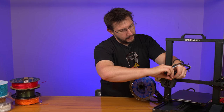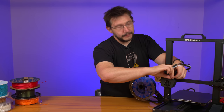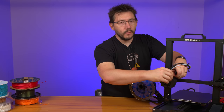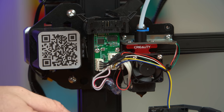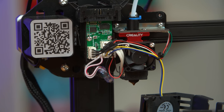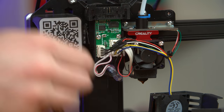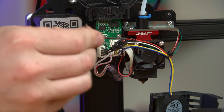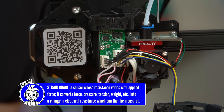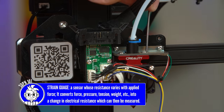To get to the next part I needed to remove a little cover held by two screws — one easy to access, the other not so much. The nozzle has a more refined point than I've seen on other Creality nozzles. The hotend itself is a new design and the heatsink behind the fan is actually slotted. I also misidentified the auto-leveling component before — I called it an FSR, but it's actually a strain gauge.